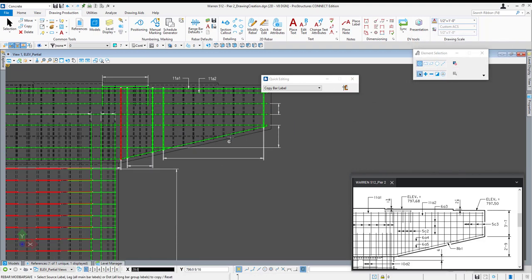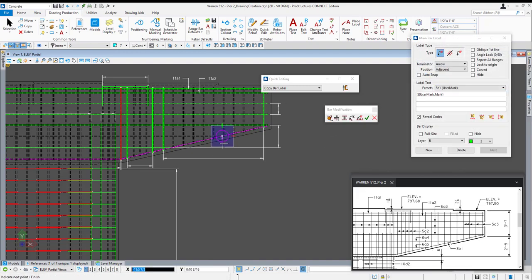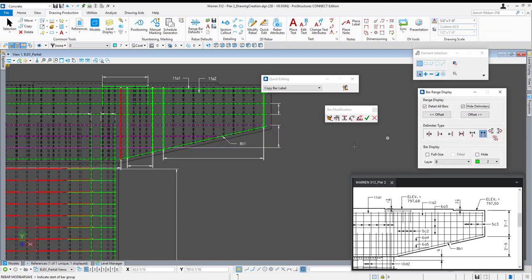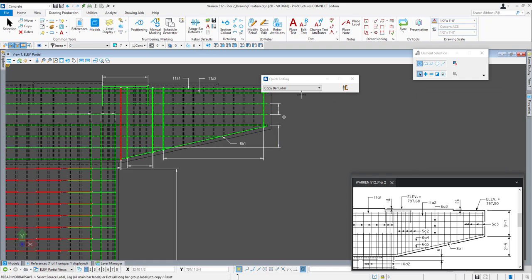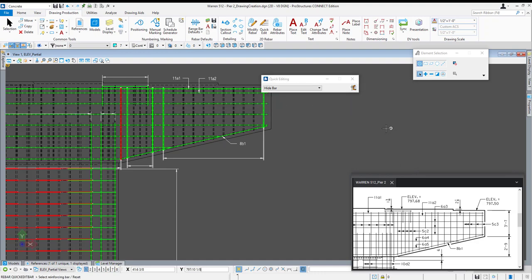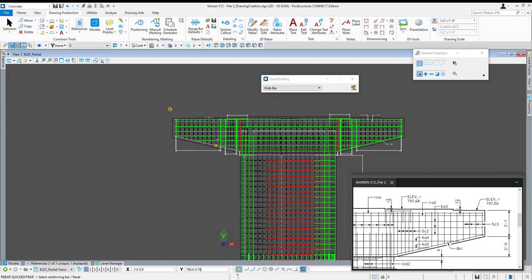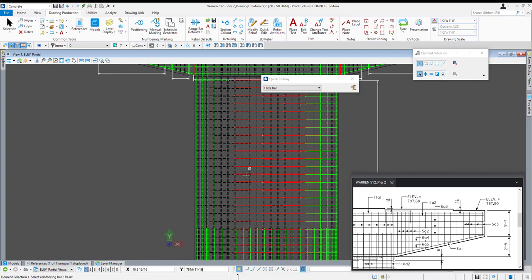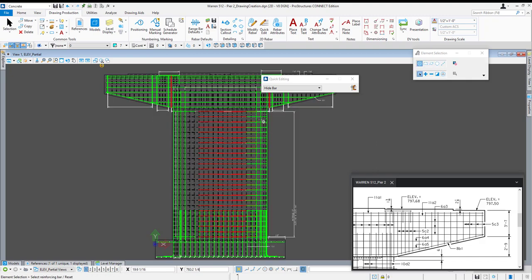And now for my 8B1s — I'm going to accept that. With these now: detail all, hide delimiters, accept. The reason you're still seeing one there is that the other face of reinforcement is visible. So I'm going to do the same thing for my top: detail all, hide delimiter, accept, and then hide the other face. I'm not going to worry at this point about anything on the left side of this detail, as it will be presented using the first elevation we created. Now the only thing remaining is our verticals.